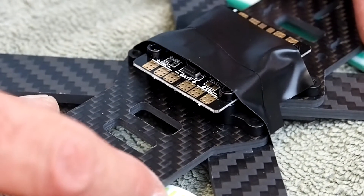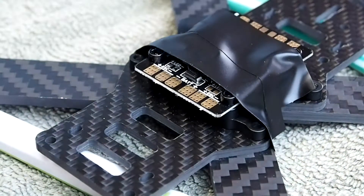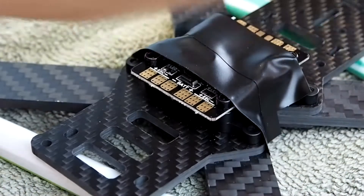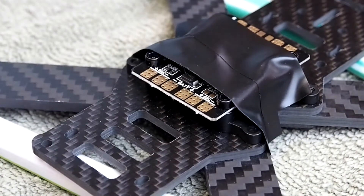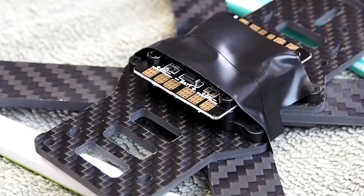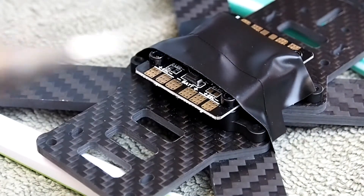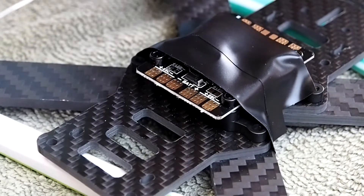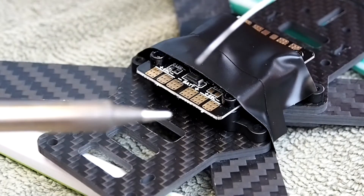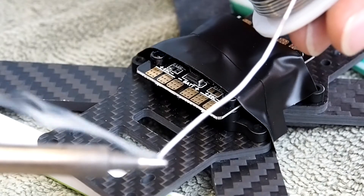I'm at 750°F, that's what I'm going to tin these with. Tinning is very simple, just like we did the wires. It's been on here for a few minutes so I'm going to clean that off — it's kind of dull on the tip. Look how nice that is. Always before you ever contact anything, tin the tip, and I'm not going to do it right over the board. I'm over here. Get a good amount of solder on the tip.